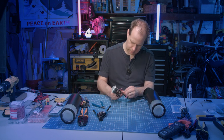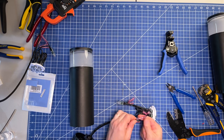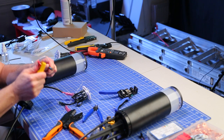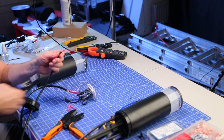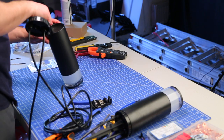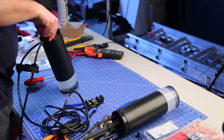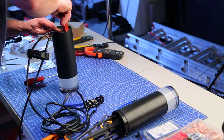Now I start making the usual connections of the positive, negative, and the data using heat shrink crimp connectors. Since the original light only had a single gland for power, I drilled an extra hole on the bottom so that I could run both the input side in and then the output back out. I'm using glands on the bottom so that the wires will be sealed from any water. I then insert the lights and line up the 3D printed part to the original holes and start screwing the plate back down. I also adjusted the height of the LEDs to be just above the glass so that the light gets diffused as evenly as possible.